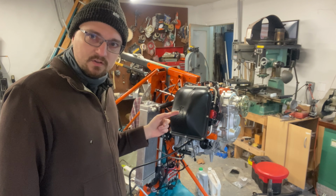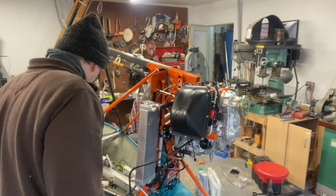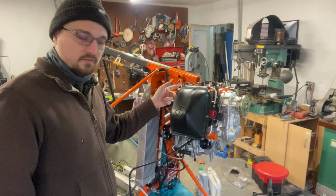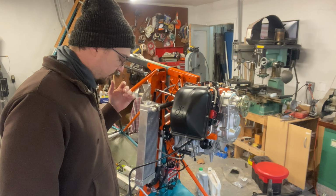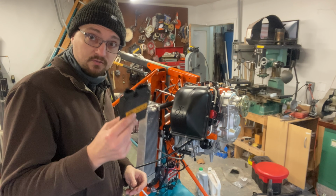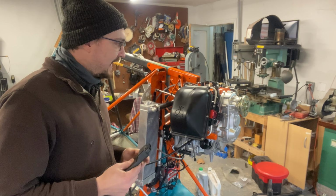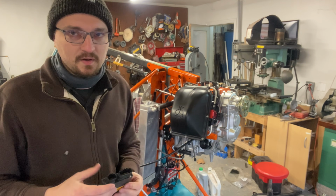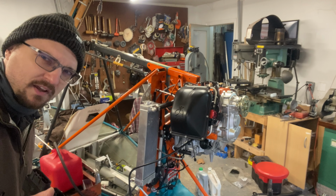The only thing I'm going to do real quick, I need to go prime the oil. I don't have an ECU in it yet. I actually have my ECU out, so no spark, no fire. I'm gonna go ahead and build up oil pressure in the engine so that everything's pre-lubed. Then we'll install this and cross our fingers and see if we can actually make this thing start on the first go. Because that would be really cool if I could do this for video and not have to play it up and go fix a bunch of things. Let's find out if I can pull it off.